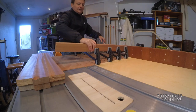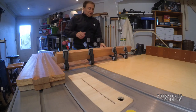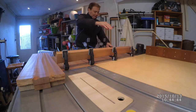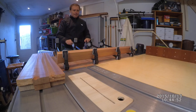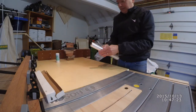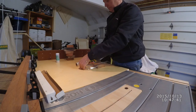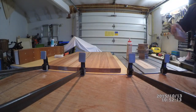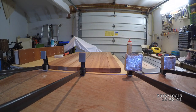Now this is the moment where I wish I had parallel clamps, or many of them. Unfortunately right now those clamps are just not in my budget, so I'll probably build some when I get around to it — and that will be a future video project. I'm using some scrap wood and kitchen cling film to create the function of a parallel clamp, although thinking about it now I could have just used a straight piece of wood across all of the clamps.